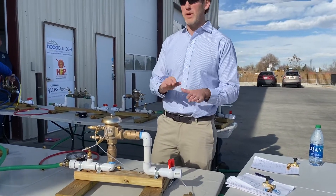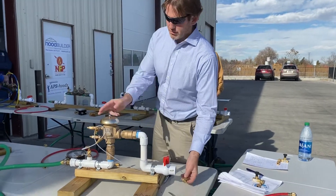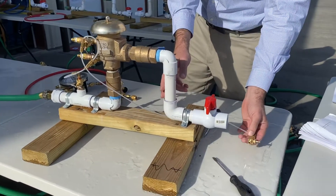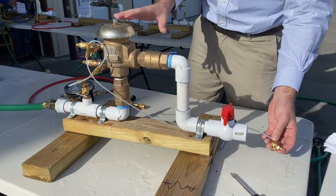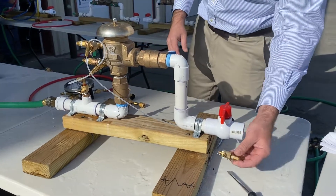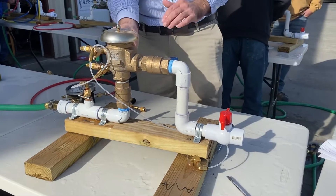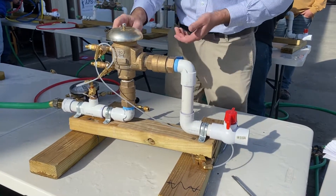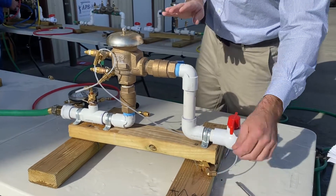Anything that's based on the USC 10th edition. Essentially, what we have here is a PVB Febco hooked up, similar to what you're going to find on the practical exam. You might find them in trees or set up independently. We have a test fitting setup that is published by USC — this is what most proctors and people hosting exams are going to use. It's essentially a series of T's and valves and hoses that hook up to simulate failures.